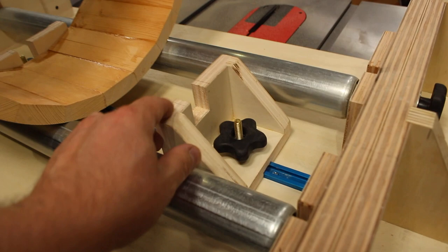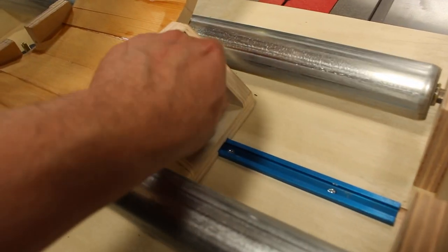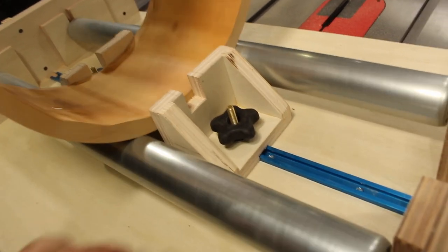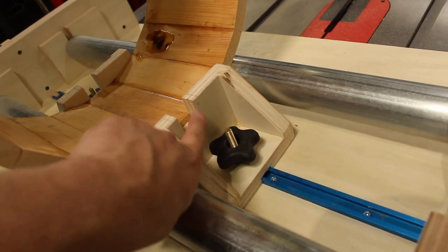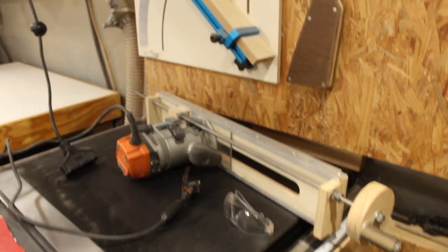This one's next. These miniature fences, which ride on the center T-track, are for locking in the shell, like bookends. Keep it tracking where you want it. They're notched for the router bit. They also support the center of the router track — the same router track which is used for the outside of the shell.